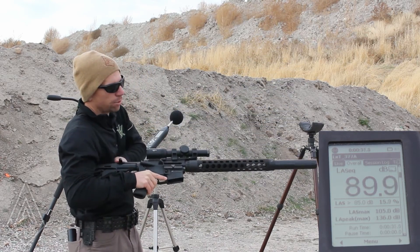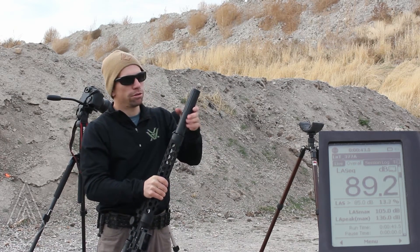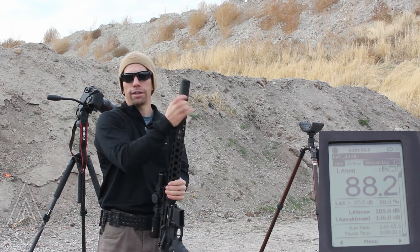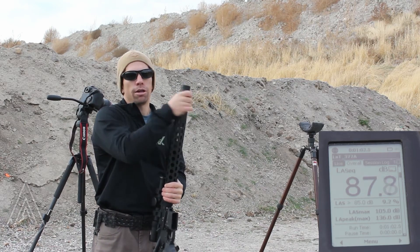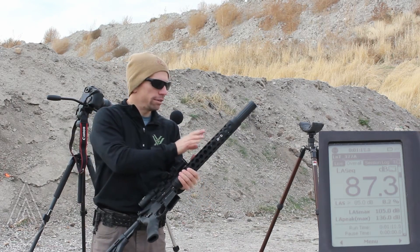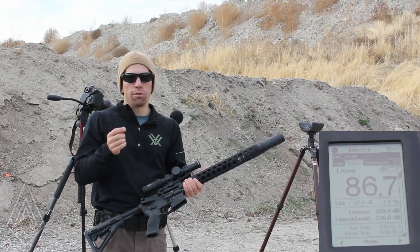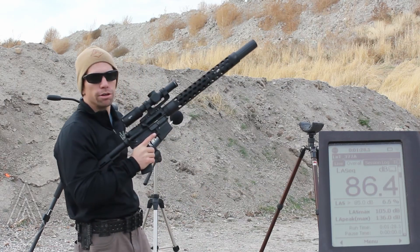Now I'm going to switch to our over-barrel suppressor. I'm shooting the CQB 556M, which is our four-inch over-barrel suppressor. We also make a six-inch version, but on this rifle I have a mid-length gas system and a 16-inch barrel, so there's not enough length for the six-inch version. Sound reduction is actually exactly the same on both. The only real advantage of the six-inch version is a little bit less gas blowback from the longer over-barrel chamber. This is an adjustable gas block tuned for shooting without a suppressor — it's my competition training rifle, normally with a muzzle brake, so it is a little bit over-gassed.